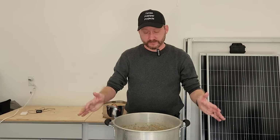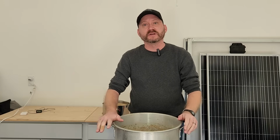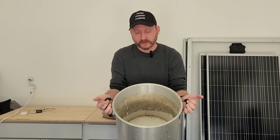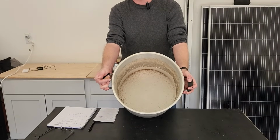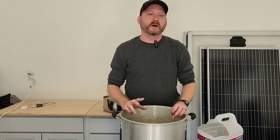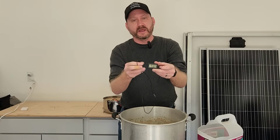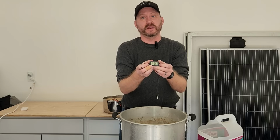So let's ramp this up. Here in front of me, I have a very large cooking pot that I got out of a junk pile. I was going to use a galvanized metal trash can, but this was free. Now, based on my preliminary experiments, I lost a lot of heat from the bottom. Down in the bottom is about 3/4 of an inch of plaster of Paris. So hopefully that ceramic will help insulate the bottom and push the heat upwards. I'm going to put about an inch of sand in the bottom and then bury the temperature probe from a thermometer that I've got down in the very bottom, so I can kind of keep an eye on it. These came from Amazon, and I know that they max out at 190 degrees because this actually errored out in my preliminary testing.